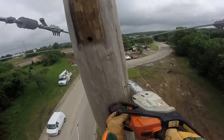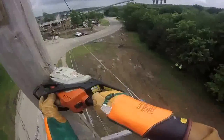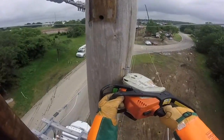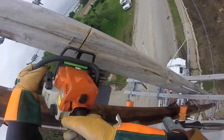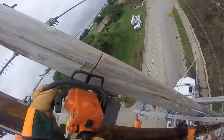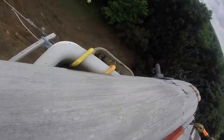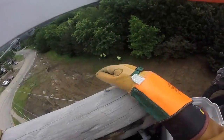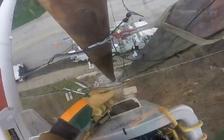Now they're going to do what's called notching the pole. They take a chainsaw out and cut from each side of the pole in order to take sections of the pole down. Notching means going over to the other side as well. Now we're going to see the lineman go up and work that section of the pole free, handing it off to his partner in the other bucket so they can take it down to ground.